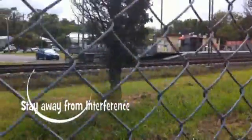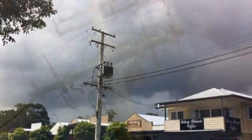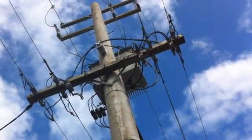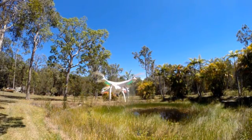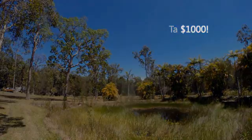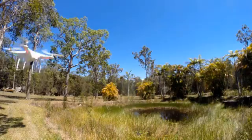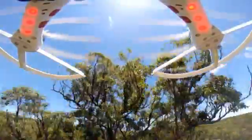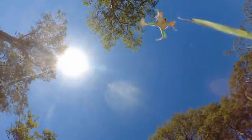Number three is flying near electromagnetic interference, which can upset the Phantom. If you see power lines, phone repeaters, or radio transmitters, just stay away. Generally the unit should go into fail-safe if you lose controller signal, so if your home position is not right, it's anyone's guess where it will go — hence a fly away. Occasionally, interference may use the same frequency as the Phantom controller, which is not cool, as the Phantom will think it's getting signal updates from you but it's not — and that new signal could be telling it to go flat out forward or maybe even to China.